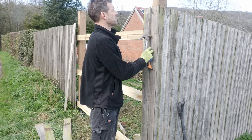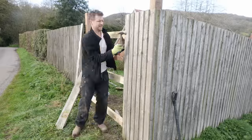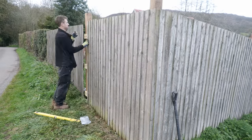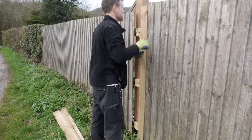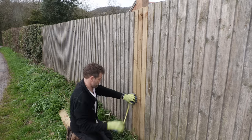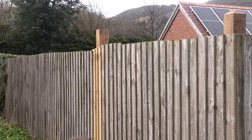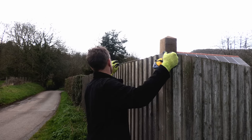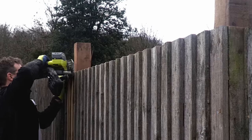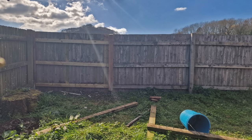Pretty much all that remained was to fix back into position the feather edge boards I'd salvaged from the collapsed fence, using 40 by 2.65mm galvanized nails left over from the garage re-roof. The whole process of refixing the boards took about three quarters of an hour. The end result of not straightening those rails or string-lining the top of the fence left an uneven top edge, so I stretched a short line across to establish as straight an edge as I could and trimmed the boards level using my circular saw. Oh well, you live and learn — I could always remove the last few feather boards and raise it up if I've got nothing better to do.